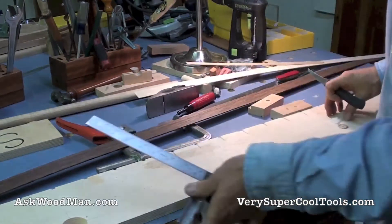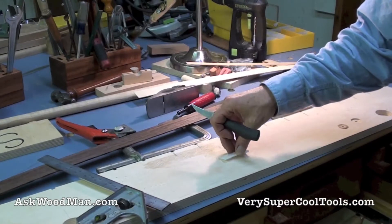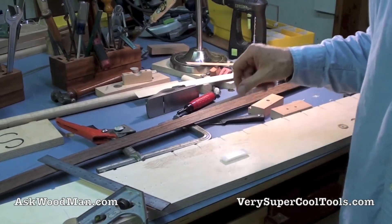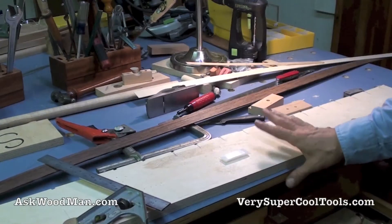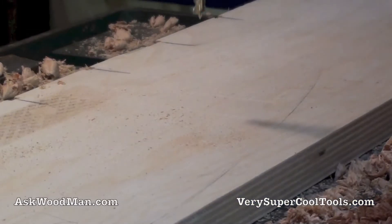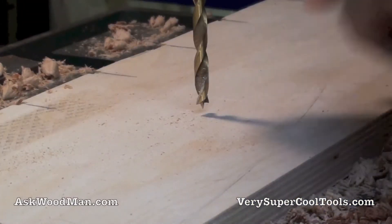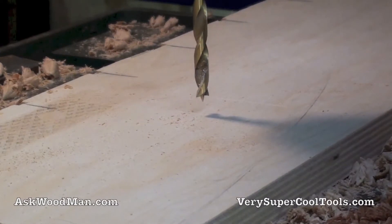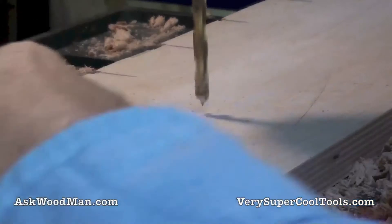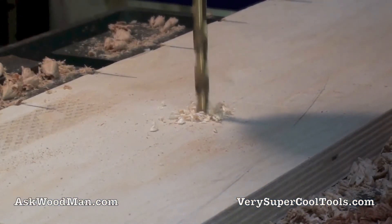One inch — so these are one inch on centers. All I've got to do is drill two quarter-inch holes, and this is going to pop right down in there and give me a way to work and support this. This is just a scrap piece off of my drill press. Here are my two lines. The depth isn't really important — you just want to make sure it's deep enough that the little stub tenons on the glide are going to go all the way in.